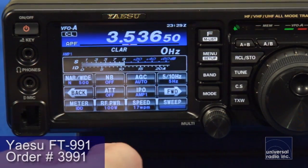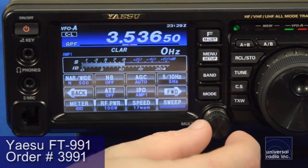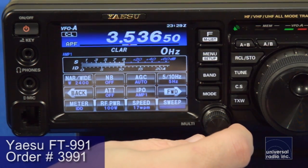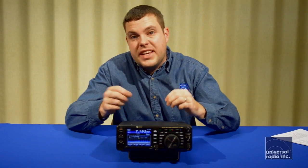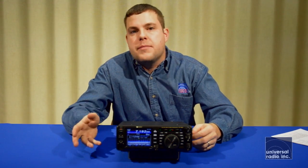One of the most impressive things about this rig is the advanced IF filters. You can adjust your IF width, shift, and contours. You've got an adjustable notch filter, and separately you've got audio level filters that can be employed for each different mode, so you can set up specific filters for CW, sideband operation, or data work. With today's more modern receivers, it's really advanced operation that's going to offer great performance even on crowded and noisy band conditions.